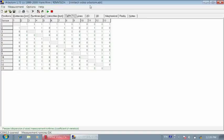While recording data, it is important to check the measurement error. We check the delta page of the program, which shows the percentage deviation between measurements across different sensor pairs. The goal is to achieve errors of less than plus or minus 10% wherever possible.